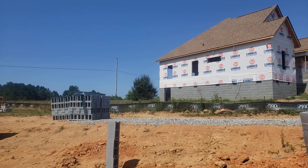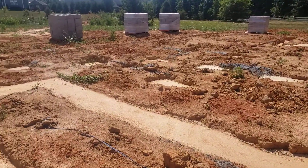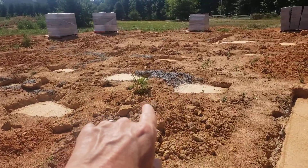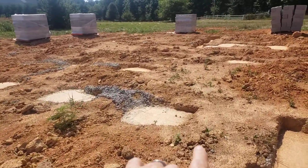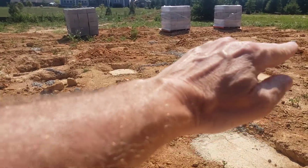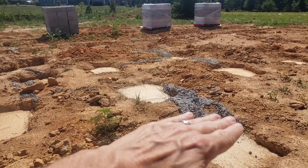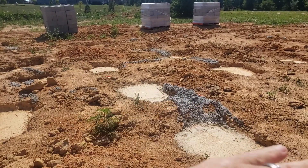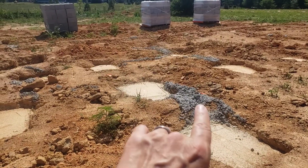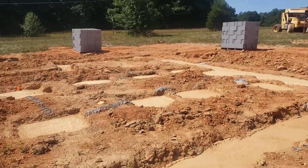So that's what we have to build here. The question always is: how high do we make our wall? These center posts are called piers — it's where we build a pier or a piling. It's just a stack of cinder blocks that holds up your floor system, and that's usually the width of a two-by-ten below the floor system. That's where we put what's called a drop girder. We want those high enough so that the structural members are not too close to the soil, and there is a code for that.